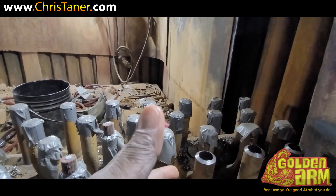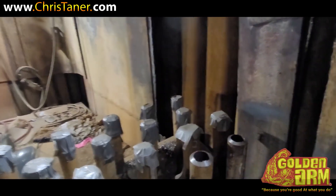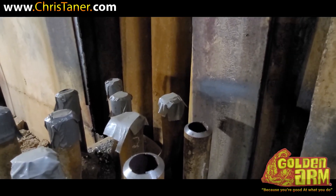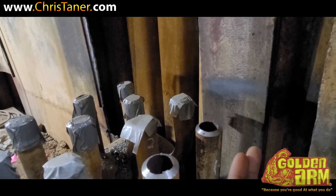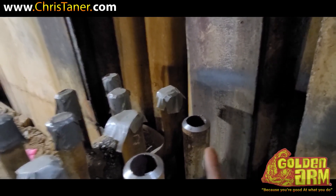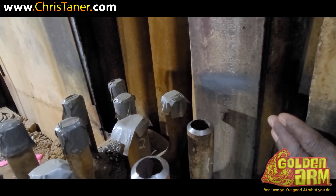For those of you who have been in boiler tubes, the best way to do this whenever you're in a tight spot getting ready to make a tube weld — this is what I do now and this works. I use a tight 3/32 gap for the high heat. Why? Because sometimes you've got to use a mirror, and whenever you get your rod in position on that bevel and that arc hits the metal, you want it to melt. You don't want it to be cold — you want it to melt and fuse. This is why I use high heat when welding boiler tubes in tight spots.